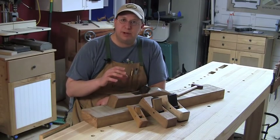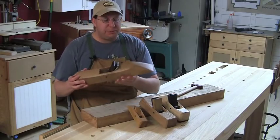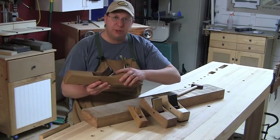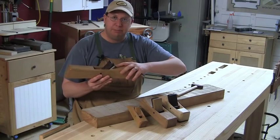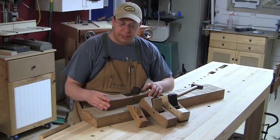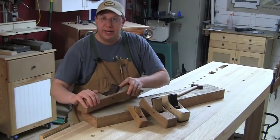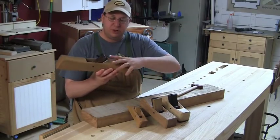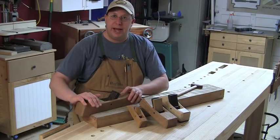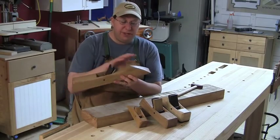Working with Scott's planes, this is probably the closest compromise you can get between the feel of a metal plane being close to the work and the height of a wooden plane. Scott's premium style planes have a very signature race-car-looking back that gets your hand really close to the work but is also incredibly comfortable to hold. A great side effect is that this angle very naturally puts the pressure of the sole down and forward, which helps prevent rocking off the edge and tapering the end of the board — mimicking the scooping motion you need for flat boards.